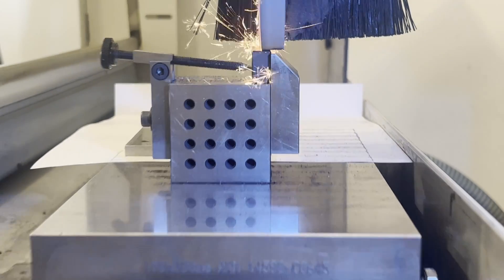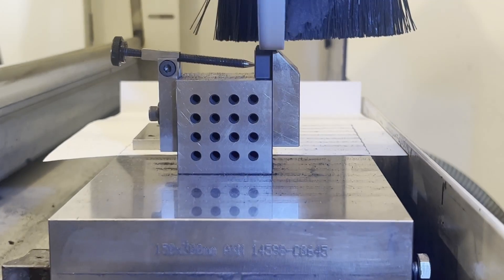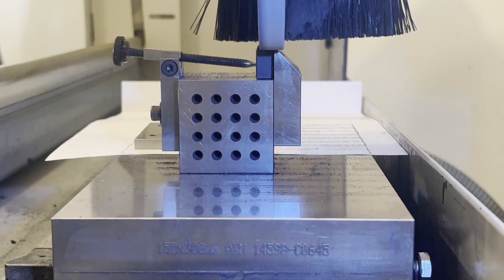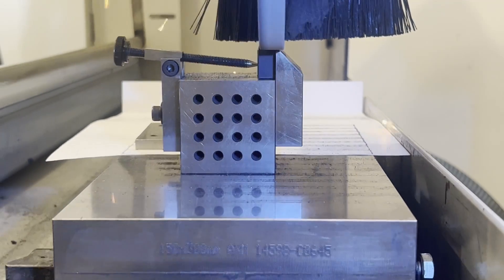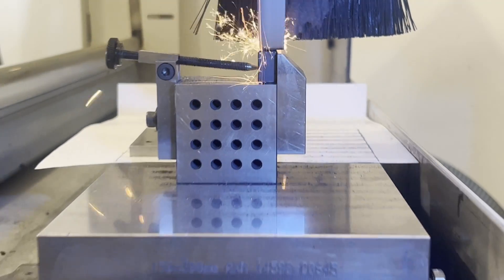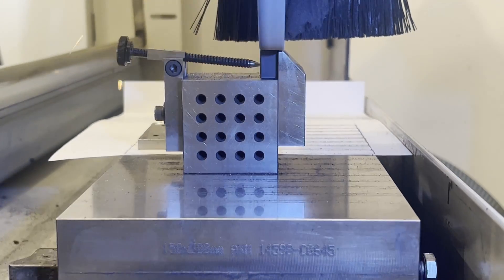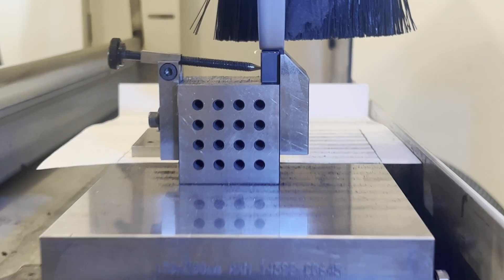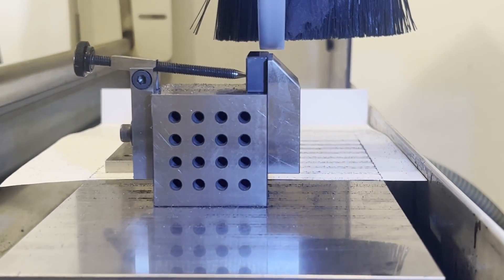As I described, it just takes a light pass and steps over, and all the wheel wear is concentrated onto the left corner of the wheel, leaving the better part of the right half of the wheel as a wiper. Once the roughing is done, the wheel goes into a finishing mode — two very light passes and then some sparking out. But you don't always need to do that depending on what you're doing; sometimes you can just feed across and be done.